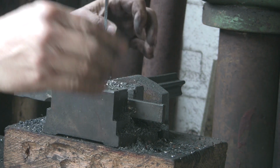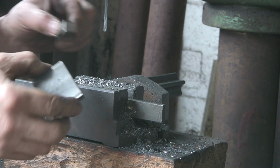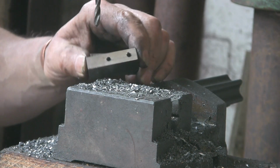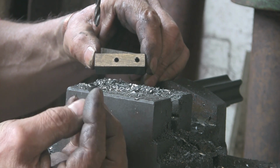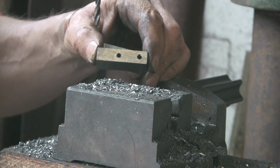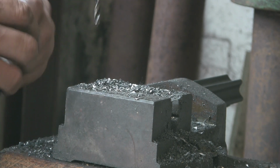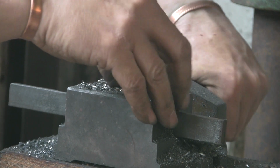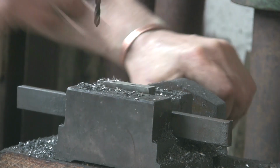Let's sculpt that one. So we've got the 3 holes done on there. So I'll do the rest of them. I'll come back so I don't bore you to death. Alright, so I've got them all pilot drilled. Now I'm using an M5 cap head socket screw, so I'm going to put a 5mm clearance drill in here. So I'm just going to whip through the piloted holes.